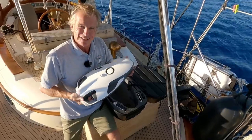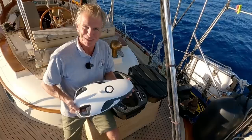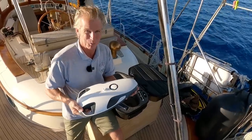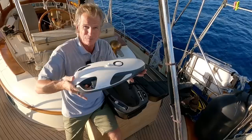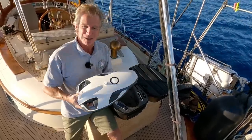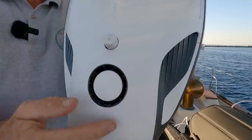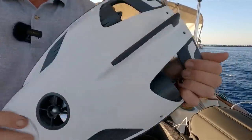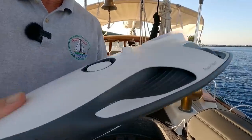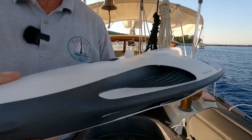When you feel it, it's really heavy. You look at it and think it's going to sink like a brick, but you forget how heavy water is — a lump of water this size is very heavy. Actually, this has very slight positive buoyancy, so if all else failed and it died, it would just float to the surface. It has impellers: one in the middle for up and down, and two at the back to push it along and steer. It's made to move — that shape means it can go quite fast, up to four knots.